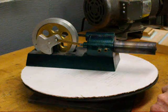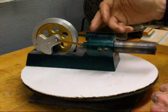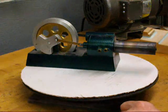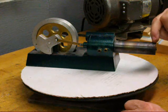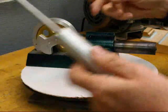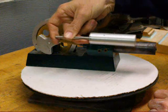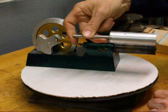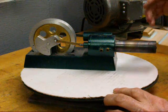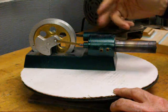The important thing on a Stirling engine is that there's a differential — hot and cold. It would work in reverse if we could make this end real cold and this end hot, but the practicality of it is that it's easier to make this the hot end. Now inside of here we have a displacer, and the displacer is nothing more than a hollow aluminum tube that moves back and displaces the air or the gas from one end to the other. If you watch my next video coming up, I'm going to go into great detail on the workings of an engine and the theory and what actually makes them run.